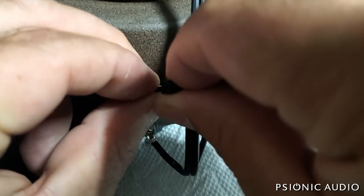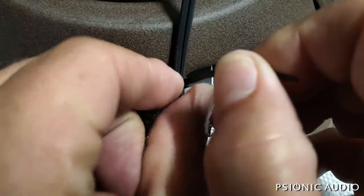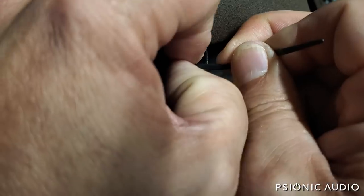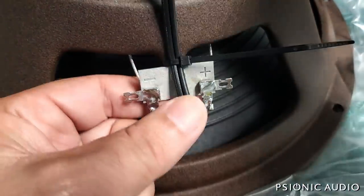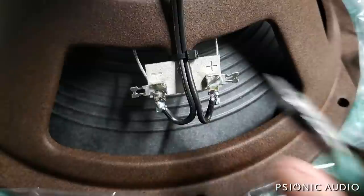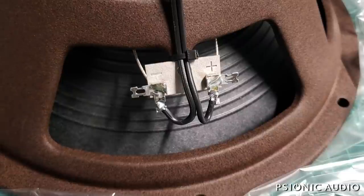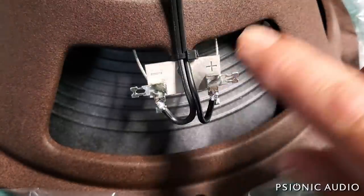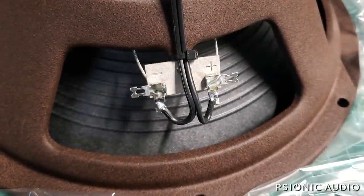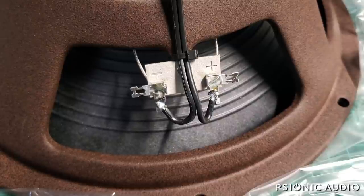Make sure I don't contact the wire leads going from the terminals to the speaker connector, which can be fragile — they don't need any pressure on them. Is this lovely what I'm doing here? No. Does it potentially save someone's butt at a gig? Yes. The old Jensens and other speakers in vintage Fenders often had little clips screwed into a hole on the frame to do the same thing. Most new speakers don't have such mounting points, but this certainly works. No one's going to see this but they'll certainly hear it if your speaker comes disconnected on a gig — and here, this won't happen.